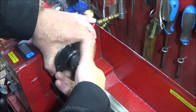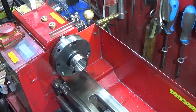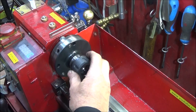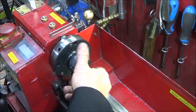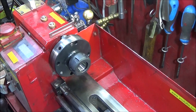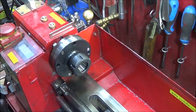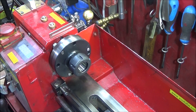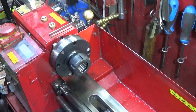I've tested the concentricity already on the angle here and it runs within a thou. The great advantage of having this collet chuck system on the Chinese mini lathe rather than having one in the taper of the spindle is that you can use it to machine bar and the bar will actually go right the way through. They're best for milling and they hold the end mills much more firmly than a three-jaw chuck. As soon as I get those collets I'll do a review on this one, and if you want to go ahead and get one of these, I'll put all the links for the tools I've shown in this video below.